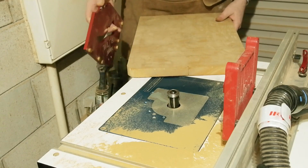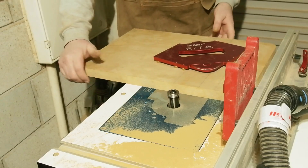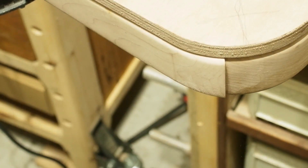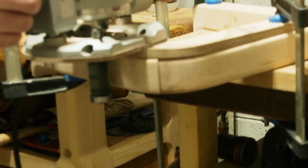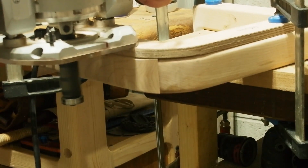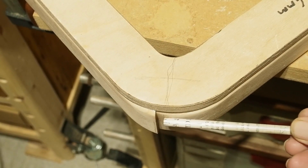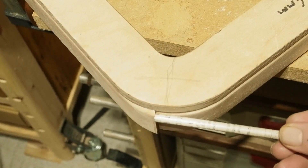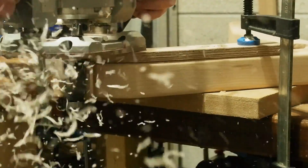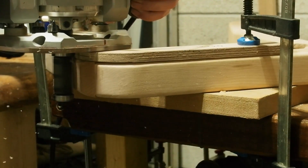Pushing the bit harder on the opposite corner, it just didn't want to round the corner in one pass. With such a large bit, it's actually reassuring it resists in this way — it would give a hell of a kick if it got bogged down, so it might well be a designed-in feature. This is a leg set for one of my tables assembled from rejected parts in hard maple. I'm happy to try the monster flush cut on them to reduce the step on the outside radius. I'm struck by how moderate it feels on the cut. The three-bladed Banggood one just won't be pushed, meaning it's hard to dig in and risk kickback. A good practice when routing — much like planing — is to go with the grain as much as is practical.